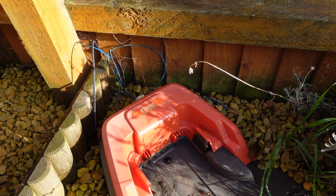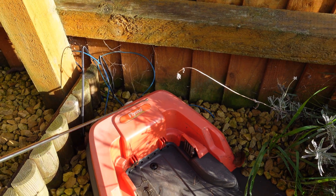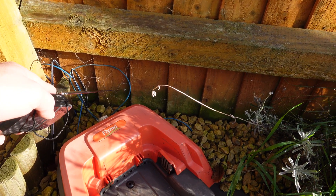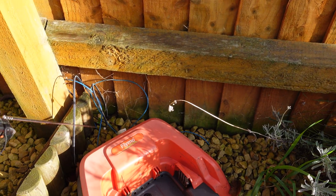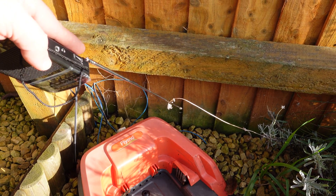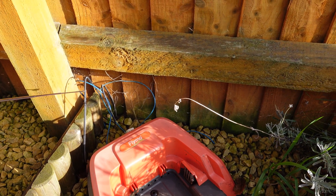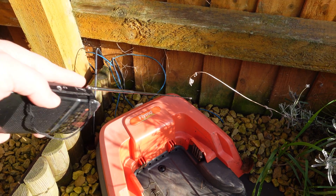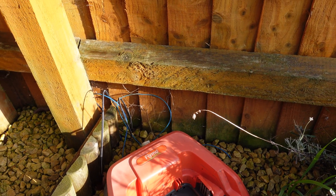To make this simple: the boundary wire works by the base station here being powered — electricity goes out through the boundary cables, follows around the garden, goes out one side and comes back in the other side. The electricity is most powerful here at the base station and slowly dissipates around the boundary cable. It's completing a loop, like a typical circuit — electricity flowing out of one end and back in the other. So if we turn this radio on...